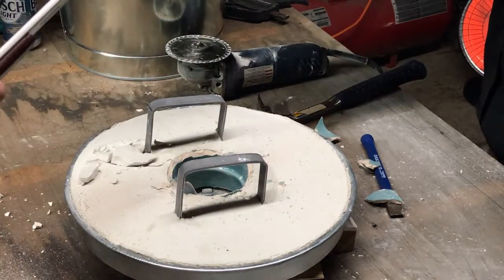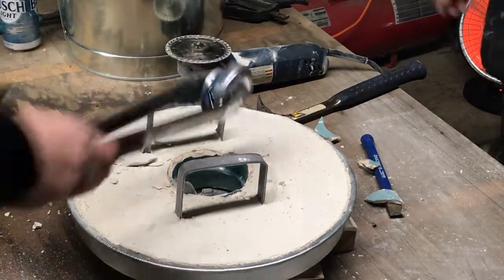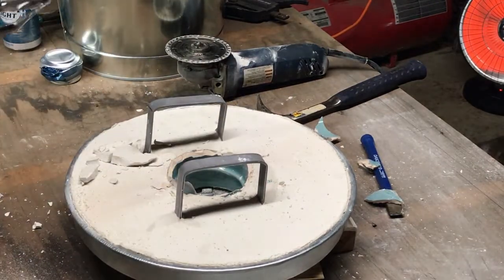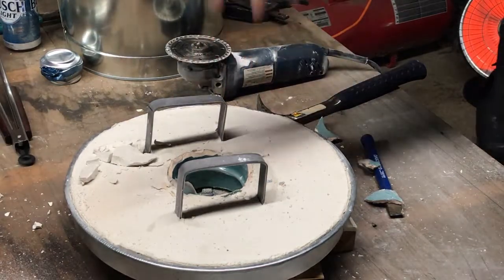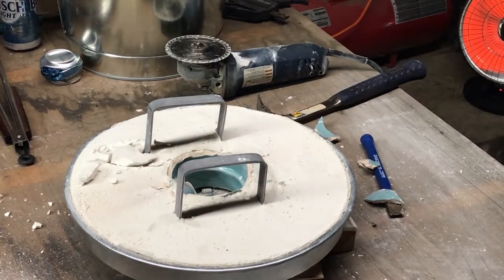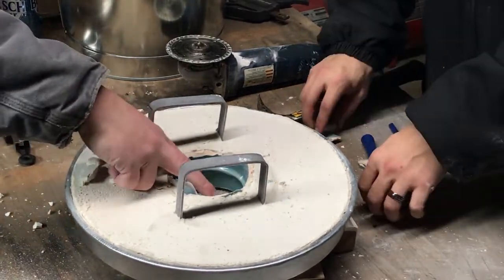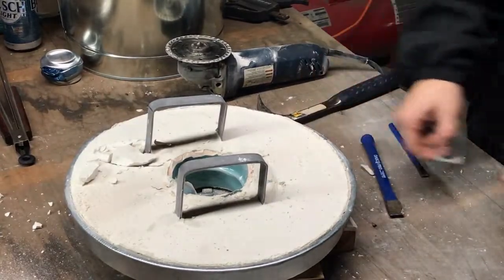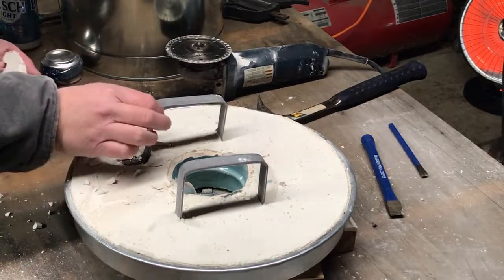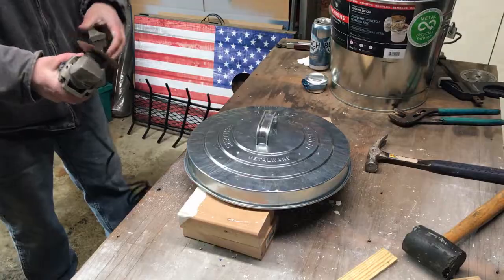Crushed cans are going to be ideal, but we're not always going to have them. We might have to, if that's the only thing that works. Also, with a long can, it may act like a guide and just send it right down into the crucible as it is. Yeah, if it's uncrushed. That's true. So the tongs may never actually have to get in here. We'll just use the can against itself. Just try not to lift with that too much, because then we'll put all the pressure there, but we can fill that in. All right, ready?